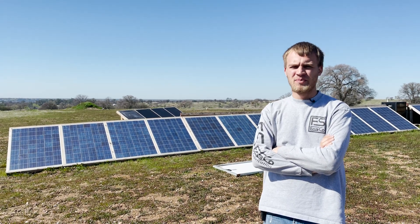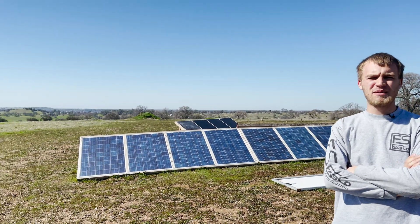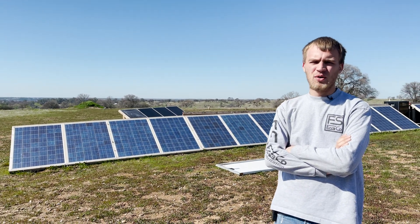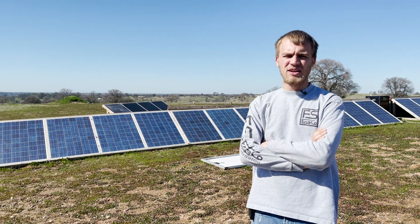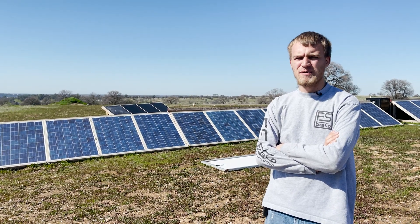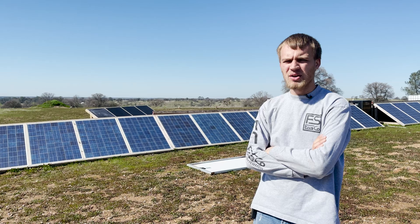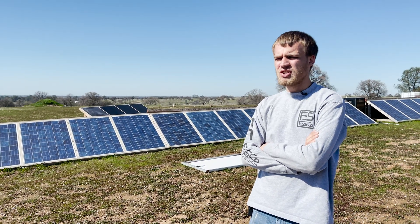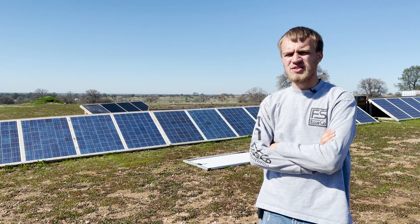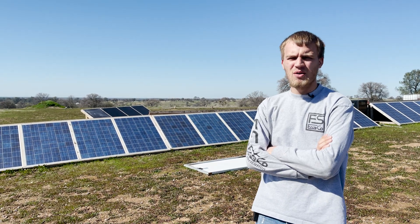Welcome back everybody, HitechLab here. We're outside at the solar array and it is quite the beautiful day for a February. We're getting ready to reconfigure our solar a little bit. We installed a Solark 12k inverter some months ago and never moved the solar over to that inverter — we were still using our Outback Flex Max 80s. Today we're going to go over what we need to change this solar system from a low voltage of around 140 volts DC up to about 450 volts DC to make it work for the Solark.